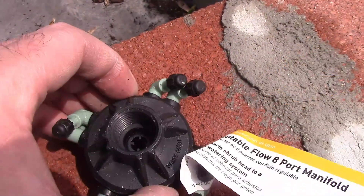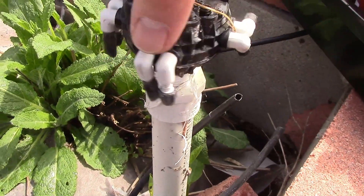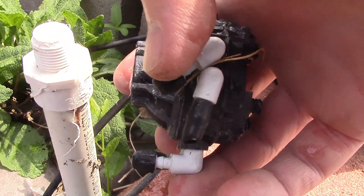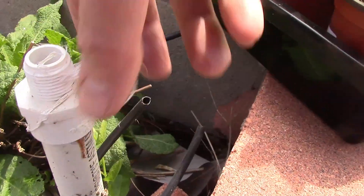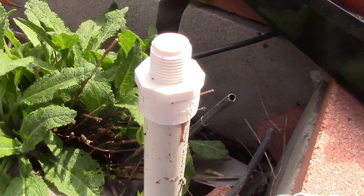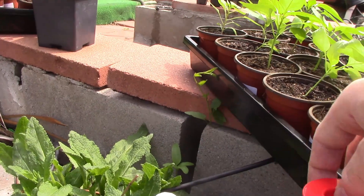We cut all the lines — it's just a matter of unscrewing it. I keep these little ends. I want to remove all this old Teflon and put about six wraps — remove it and then wrap it up with more Teflon and put the new one on. I'm wrapping in the direction that it's going to tighten, and then I put some force on it.